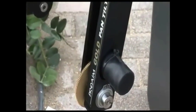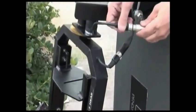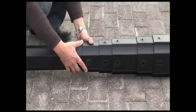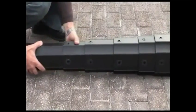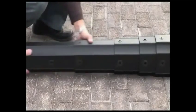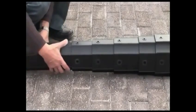You pass the necessary cables along the jib arm, which reach to the rear control center. The Pro 22-foot crane has the ability to telescope and nest within itself. The crane's modularity is built on its lightweight octagonal high-grade aluminum 4-foot extension sections. Portability is phenomenal — each extended section easily slides into the previous one, making the jib arm highly compact.